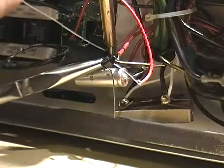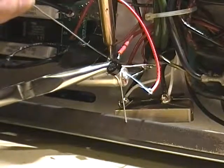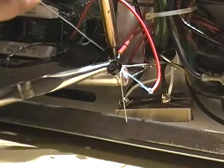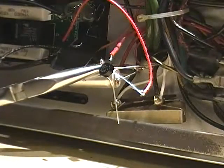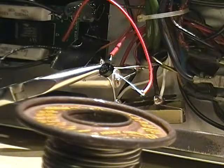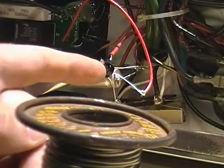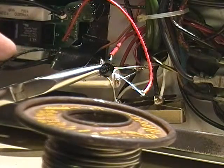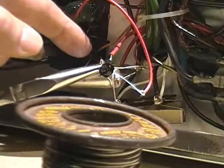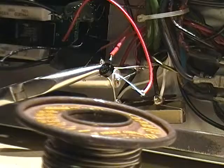That's soldered on. Now I've got to solder that onto the board better — you can see it's not quite on the board. That's the 6 o'clock position, because that's our negative. Let's move the soldering iron and add a little more solder to get it to hold. Solder's good. We've got three different things soldered in that spot: the 6 o'clock negative leg of the bridge rectifier, the wire going up to lead E on the kit board, and the ground wire that was already attached. That part's done.